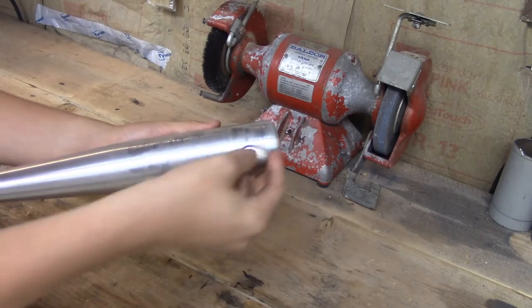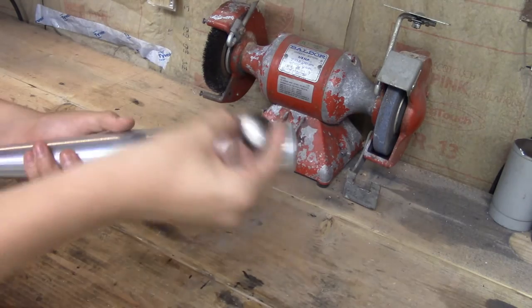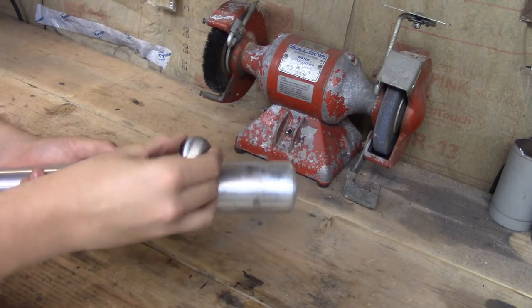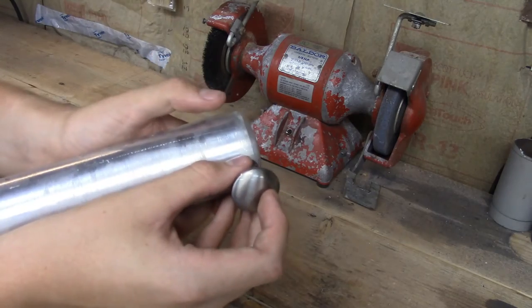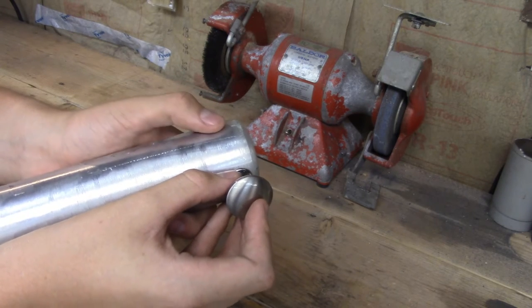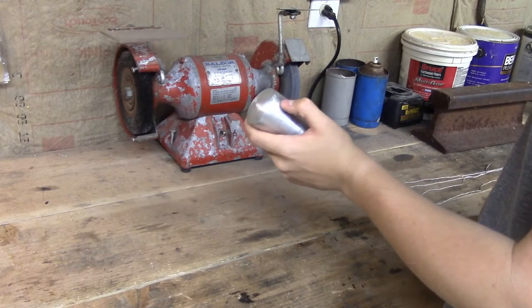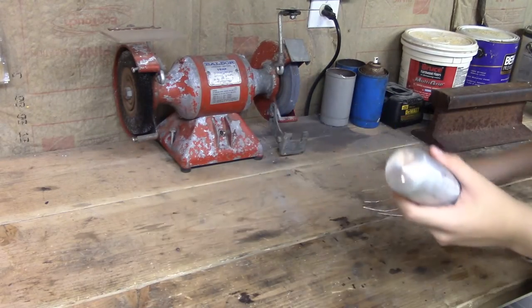So for 24 drawer knobs, there's going to be 6 rows with 4 drawer knobs each. Every other row is going to be a bit offset so they can all fit on the bat. Also, in each different row, there's going to need to be 2 separate levels so that the rods don't cross. Now, since I really don't want to use marker to mark all the lines that I'm going to be drilling, I'm going to use string instead.